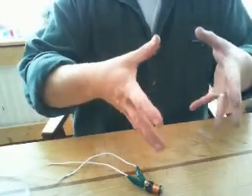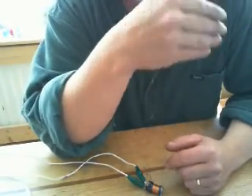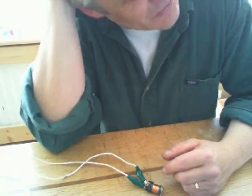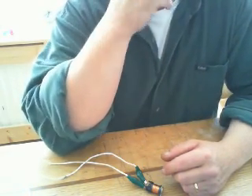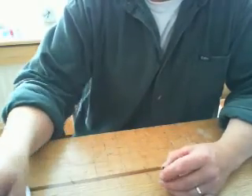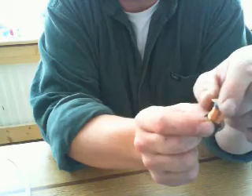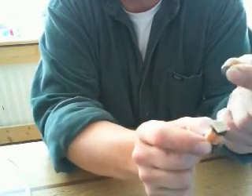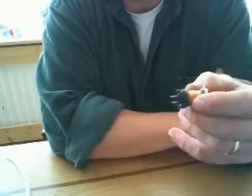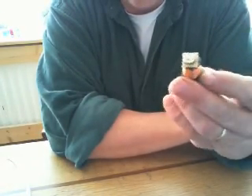The possibilities for this thing are endless. I'm just looking around the house finding things that I think are going to work. Some things work better than others — if it's a thin stiff surface like the bread tin, the cooking bowl, or the ice cream carton, or the coffee can with a bit of an enclosure, you're going to get a lot better result. The flat things like the bit of paper, the cardboard, the notebook do give a sound and you can hear it, but obviously not as good as the enclosed stuff. All it is is an induction coil, a bit of rubber band, and a small magnet. Connect the two pins to where your speakers come out and you can turn just about anything into a speaker.